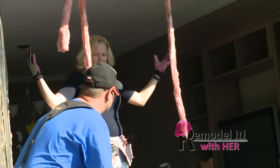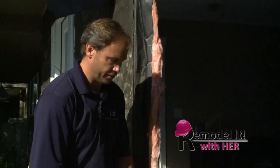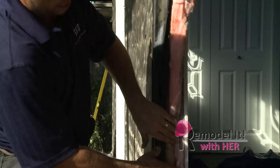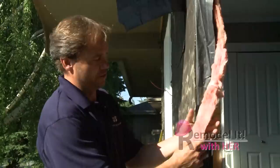So Chris, is this typically what we insulate with nowadays or are things very different? It's very different now — we use an expandable foam. This is the old batt insulation which they would just cut up into strips and place in here. As you can see, we got about a one-inch piece that was probably sitting loosely; the rest of the cavity was uninsulated. What they used to have to do is shove it in after the fact, squish it down — so it's really defeating the purpose. Insulation needs air inside of it; compressed like that is not good.